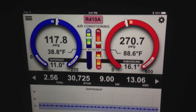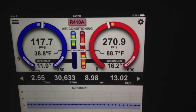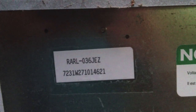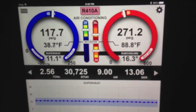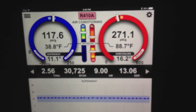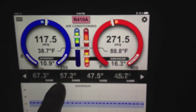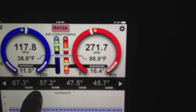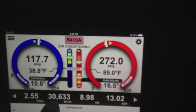Now, a couple of things here that we need to know: why are we running 30,000 BTUs? Because if you look here on the label, this is a 3-ton system — O36, RARLO36. Well, there are two reasons. Number one is that I have my airflow dropped down 10% — it's at 1078. I have it at 1078 to dehumidify better here because I'm in Ohio. The other thing is I have this extremely low return air dry bulb temperature, and that is going to significantly impact the capacity. That's why we're seeing that low capacity.